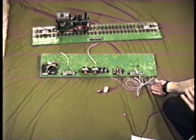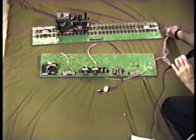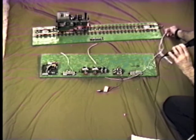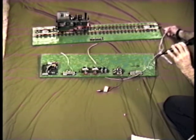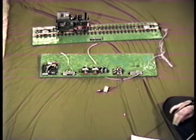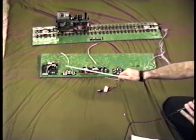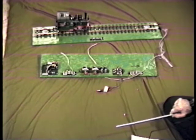— as you remember with the magnetic unit, there was a track contact T1 which set the block to red as the engine passed over it. That gets replaced by this electric eye, which gets mounted out in the track just at the exit of the block. An engine exiting the block would set the block to red by passing over the eye. This eye control unit replaces the 1201 motor and the 1203 points.